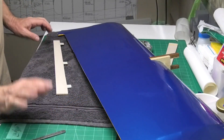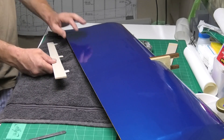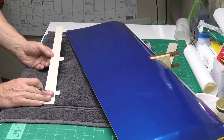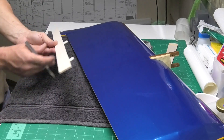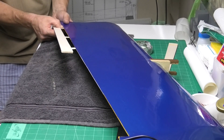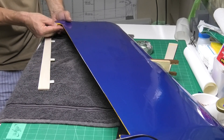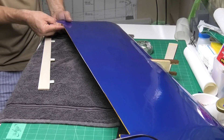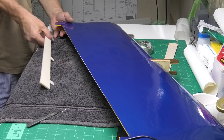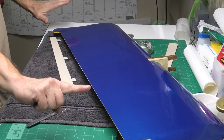I've learned quite a few things today — like don't use two different materials. One thing to remember before covering the ailerons, elevator, and flapperons is to make sure we know where the hinge slots are in the wing itself. We put in the mylar hinges into the aileron flapperon and then line it up and locate the hinges. If we don't do this we'll get to a point where the flapperons are covered and the wing is covered and we have no idea where our hinges are, so it's best to do it at this halfway stage.